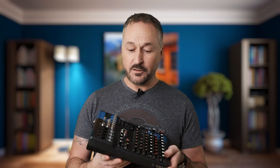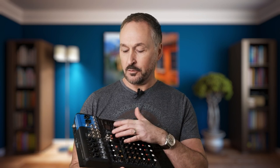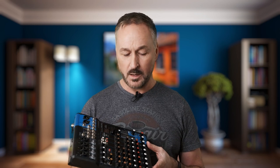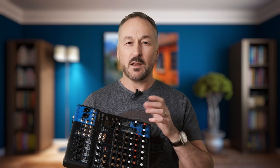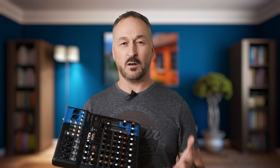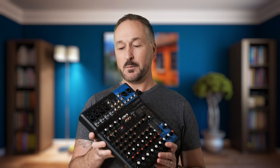So if you've got four guests or three guests and yourself as host, you're only getting one audio channel out of this when you come to edit it in your software. If you want multi-track you need to buy a multi-track version. It's got some compression dials but only on the first two channels and it's also got 24 bit 192 kilohertz audio quality in there which is recording standard for music — way beyond what we ever need. It has special effects like room echo and voice effects you can put in there if you're doing live streams. Apart from that I think it can be a bit overkill.